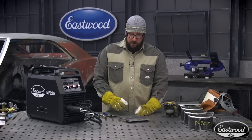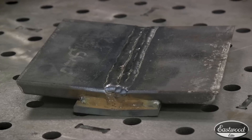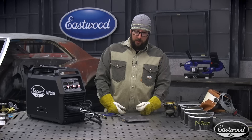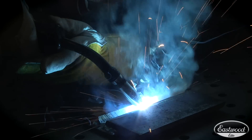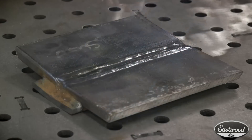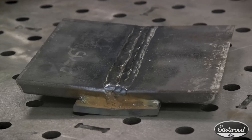We were doing some MIG welding with the MP200i. With this V-groove, it's a multiple pass — you've got a root pass, then your hot pass, fill passes, and cap passes. This is something similar to what you're going to see for a welder qualification, whether it be AWS or ASME. It was a great, smooth arc with nice crisp penetration. The wire feed system didn't falter, and I had it cranked up pretty good. This is a half-inch plate and you can see it's already warped up pretty good.